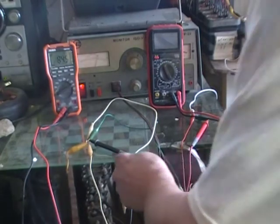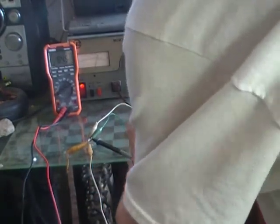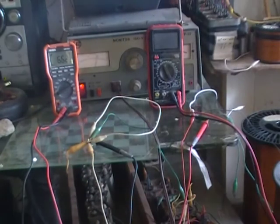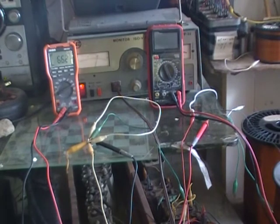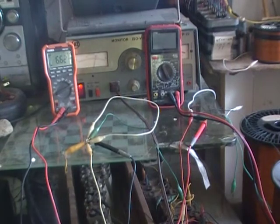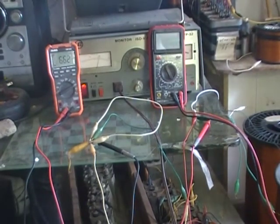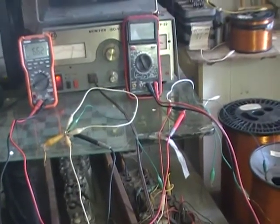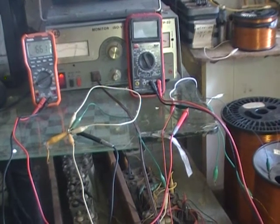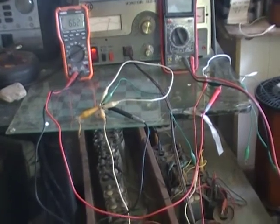Accordingly, we've got 84.5 milliamps from 100 volts, and we're setting it from the center point out. A little spark in there. That's showing 6.62 reactive milliamps from the 100 volt source. Now, it's the source frequency of the company, the 60 hertz, that determines how effectively these measurements cancel each other. That's what we're seeing today. 6.6 milliamps. Okay, now we're going to take that short out of there and place the short across the inductive component.